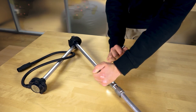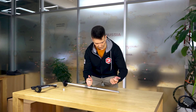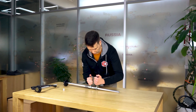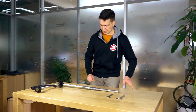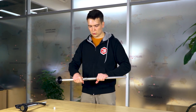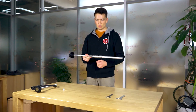I am going to show you just how it's done, but I'm not going to apply too much force here — just to give you some idea. So this is actually clockwise, like this. You will probably need to apply a bit more force than I do. And since you are going to calibrate the sensor, you would probably want to avoid the fuel dripping through any seams. You don't want it trickling through this fitting, so you could apply some insulation tape to cover it and prevent the fuel from escaping from the tubes.